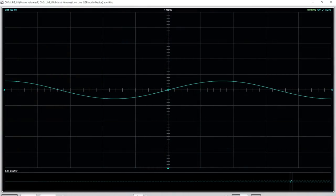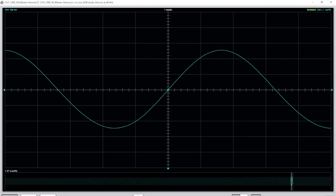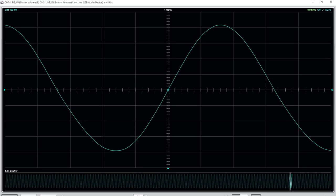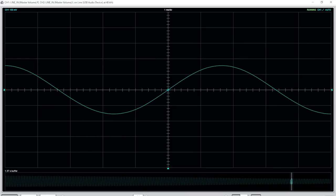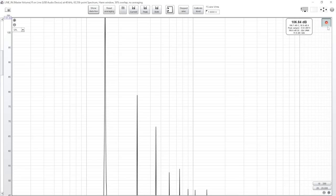So on the RTA then, this lower frequency starts off looking perfectly clean, and it continues looking beautiful. This is the first time we've ever seen this 150 hertz, 25 scaled, look beautiful. All the way up to 15 watts, it didn't even deform once. Wild, absolutely crazy clean at the lower frequency. And we get the fundamental standing beautifully proud on its own, only with some harmonics coming when the fundamental is way off over the screen. So it's super, super clean at this low frequency.